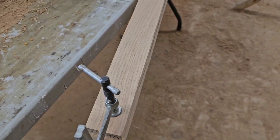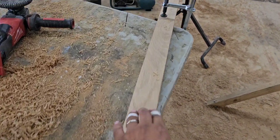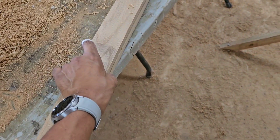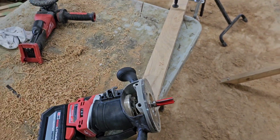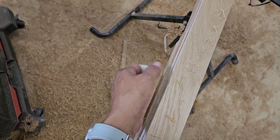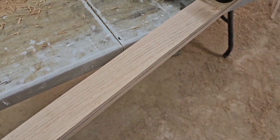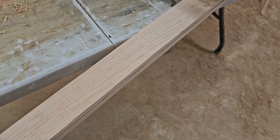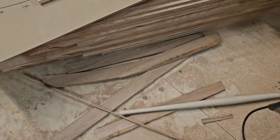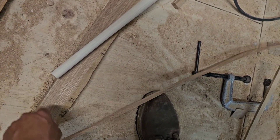This is something else I wanted to show you guys. Once I have one piece cut exactly how I need it, sanded and straight, after cutting it with the jigsaw a little bit bigger than what it should be, I hit it with the router and it comes out a perfect match. The reason for cutting with the jigsaw a little bigger - I've done it leaving a half inch bigger and once I use the router it chips it off, eats it up in some cases and breaks it. Let me show you guys.